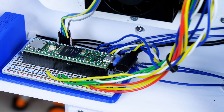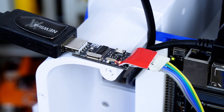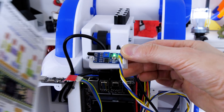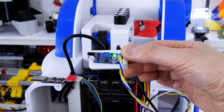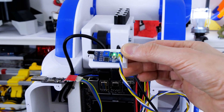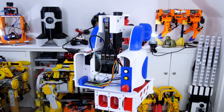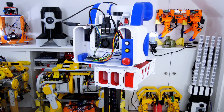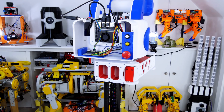I'm using some code from the Arduino Playground website to read that encoder and then position it. I'm using an additional USB serial interface for debug on serial 6 of the Teensy, because serial 0 is in use by the ROS serial library communicating with ROS and all the code on the Arduino. We need some sort of limit switch at one end of the axis so we can home the axis, zero the encoder count, and make sure it doesn't overrun its end stops. I'm using an optical proximity sensor from eBay which gives us a digital signal and has its own adjuster. Now we can write code which homes the axis till it gets to the top and zeroes the encoder count so it knows where it is.